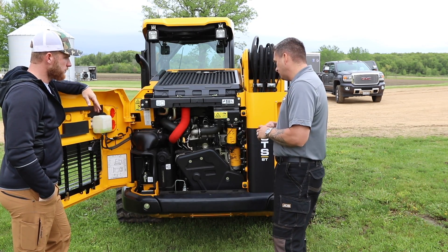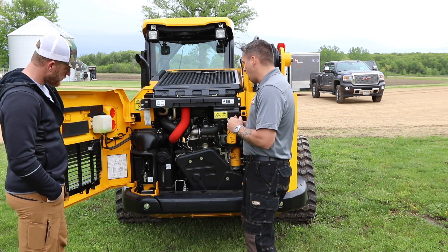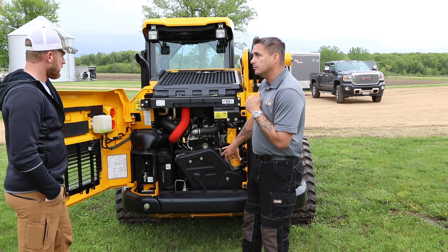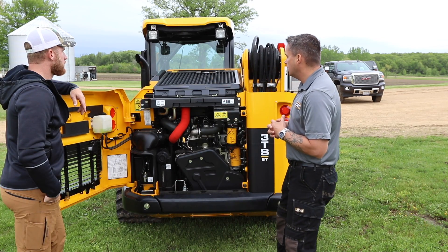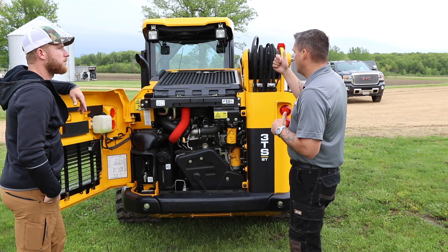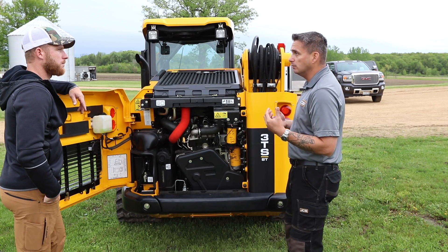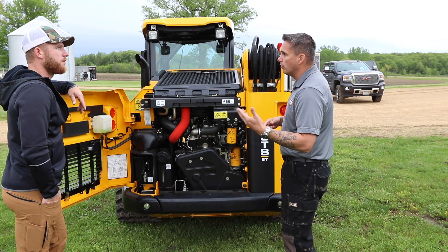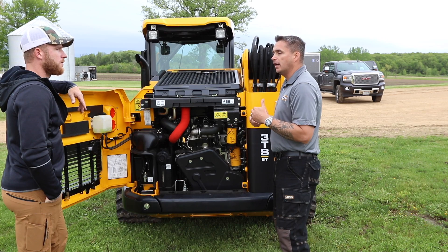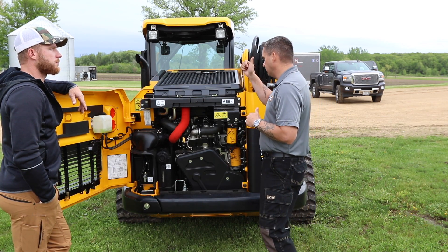All your filters are easily accessible, located at the rear of the machine. You've got your dipstick and a sight gauge for hydraulic oil. There's an isolator key that kills power to the machine for servicing. This machine also comes standard with a reversing fan that activates every 15 minutes to blow debris out — very useful in high-dust environments. And if you need it more frequently, there's a button inside the cab to trigger it manually. One operator at a peanut farm loves using the manual function.